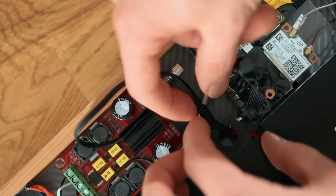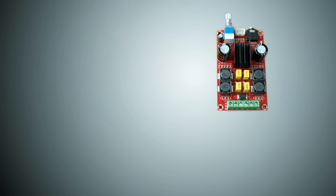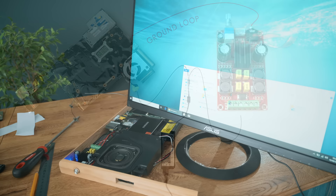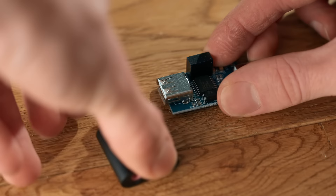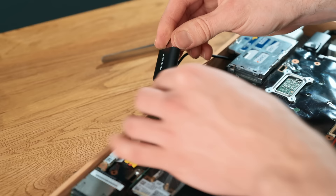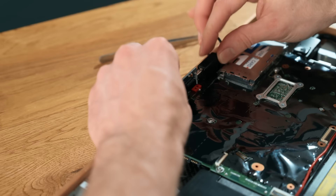Connecting it to the laptop's headphone port, I encountered two problems during testing. The first is that the audio quality from the headphone port is very poor, with thin bass and grating treble. The second is that because I'm powering the amplifier from the same power source as the laptop, there's an inescapable interference noise caused by what's known as a ground loop. To get around both issues, I bought a USB power isolator as well as a USB audio interface, which sounds much better than the laptop's original output, and because it receives its power through the isolator — which creates a new virtual ground — the ground loop is eliminated and the interference noise completely disappears.